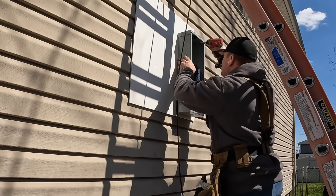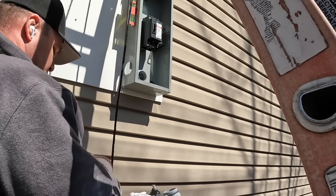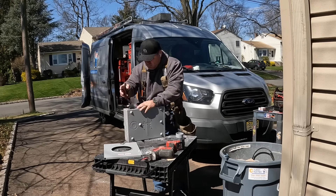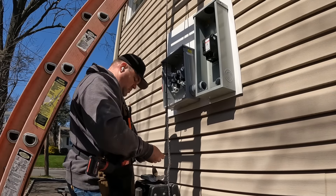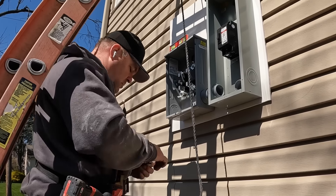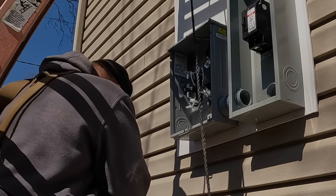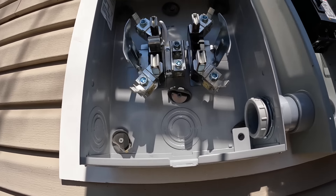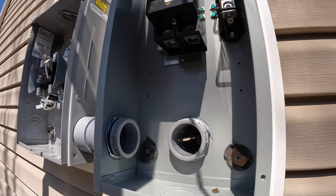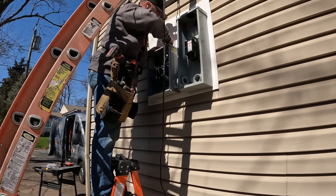It was a very windy day. Once I have the male adapter on the back of the service disconnect, I slide it over the conduit with glue and drive four-inch weather/corrosion-resistant screws — needed because of the vinyl siding, insulation, and original siding behind it. I was able to locate the stud on both the service disconnect and meter positions and get one or two four-inch screws into actual framing studs. It's sturdy and it's not going anywhere.